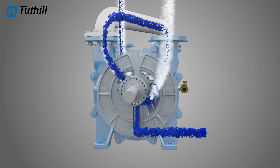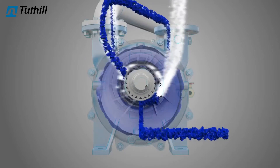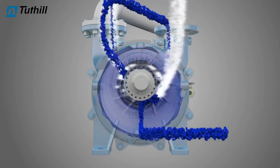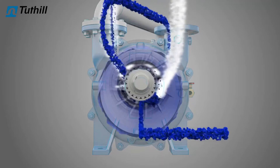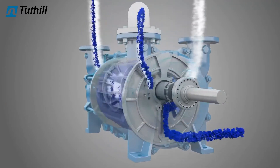The blades, although rotating concentrically, are located eccentrically with respect to the casing and to the ring of liquid. The pump's axial suction and discharge ports are exposed to the void but are separated by the impeller blades and the ring of liquid.